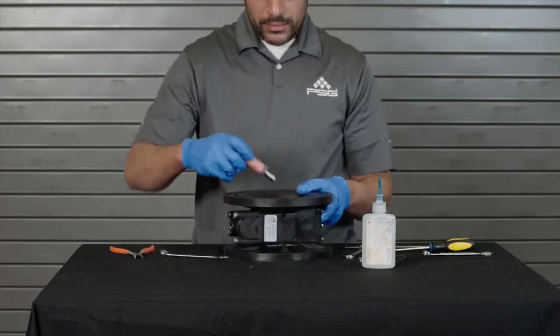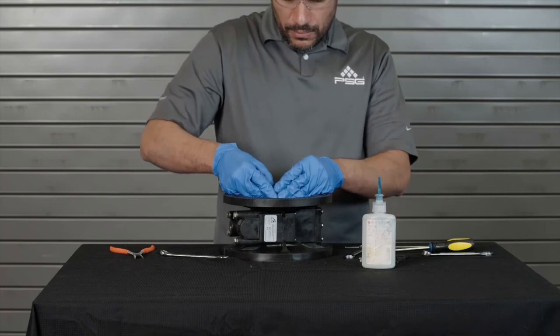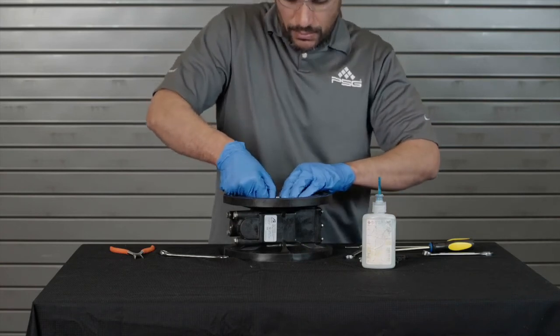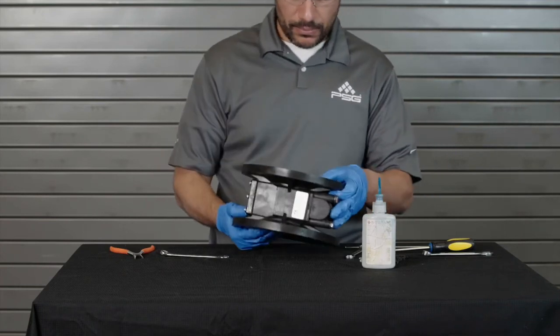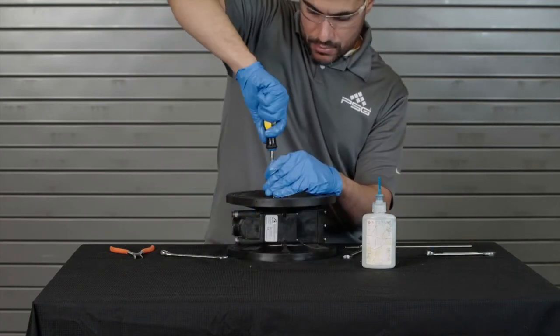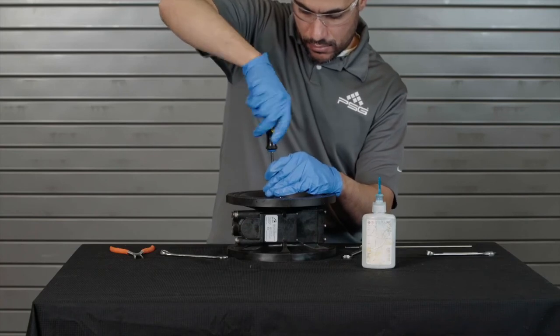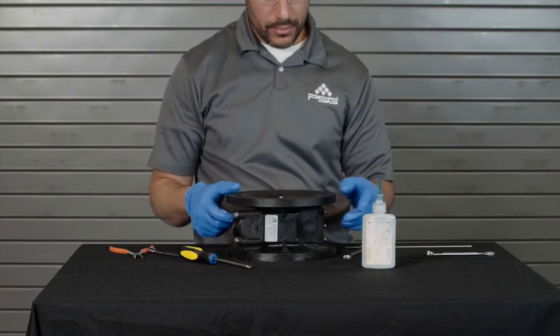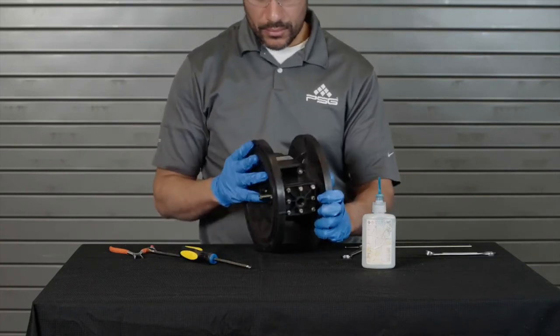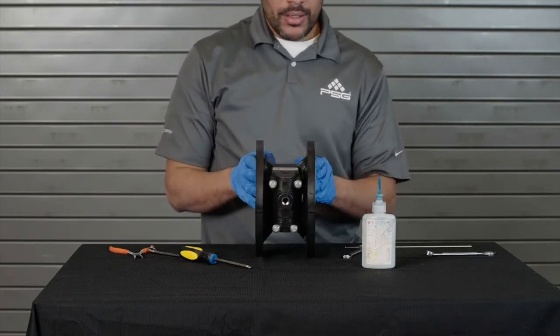Lubrication of the pilot sleeve assembly with a non-synthetic lubricant is recommended in order to facilitate reassembly into the intermediate. MagnaLube or MagnaPlate are recommended for assembly lubrication. Refer to the detailed parts list in the A100 plastic 1-inch pump manual for ordering information. For more information on maintaining your All-Flow plastic pump, please visit allflow.com and our download library.